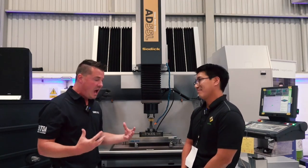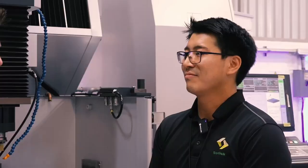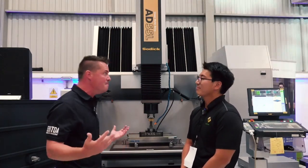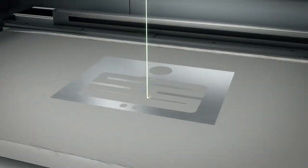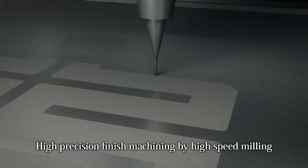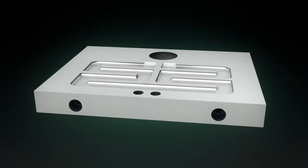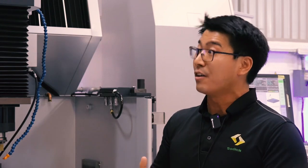One of my favorite topics: additive manufacturing and 3D printing. There are many types — DED, FDM, binder jet — but we have a powder bed system. Why is that so good? We need density. Most of our customer base is in the mold and die industry — we want a functional final part. A powder bed is going to be able to do that. What's really unique with our system is we have a one-process milling machine where you can finish 90–95% of the part, because not only do you have the laser additive capability, you also have a 40,000 RPM mill that operates in the same machine. So you're 90–95% of the way done for your part or mold.